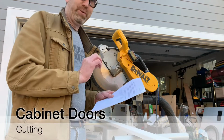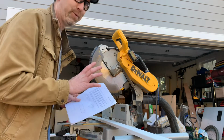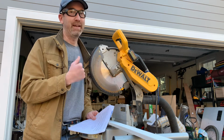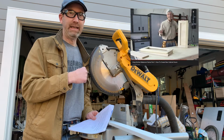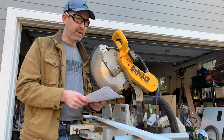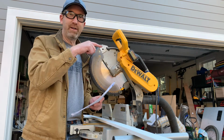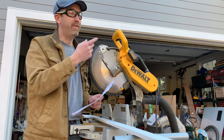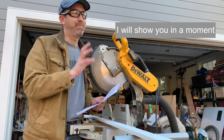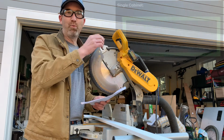I am going to do a quick overview of cutting. It seems simple, but there are some tricks. Full disclaimer, I got these from watching the Kreg Jig video on how to build cabinet doors. It's really well worth the time. I'll put a link in the description so you can jump to it if you want. But the Cliff's Notes version is: you look at the thickness of the boards that make up your cabinet in your van, and you add that to the inside dimension, and it ends up splitting the difference and giving you the perfect width to cut your wood.